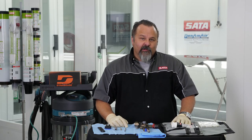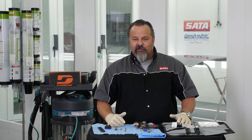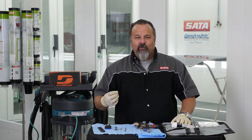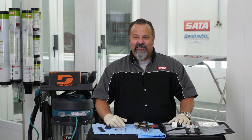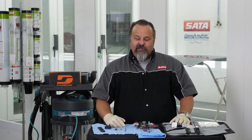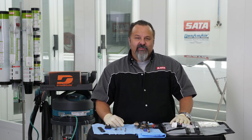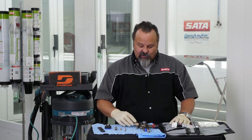We've recently released a couple of videos on gun cleaning. Cleaning a spray gun by hand is usually the best way to take care of it, or if you're using a machine. Either way, if you're doing it correctly, you still need to use a proper gun grease at the end of that cleaning process. You don't need to do that every day, but maybe once a week in a busy shop. Most painters doing this once a month will really make their spray gun last a long time.